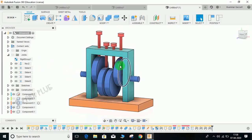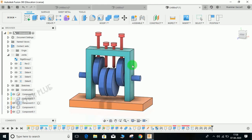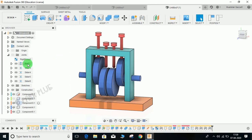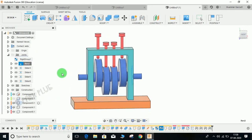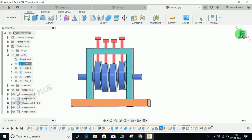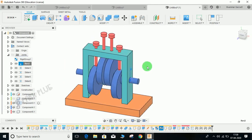Your assembly is now complete. Hide the joints, and when you move the cam all the followers respond accordingly. You can further add a handle and other details as desired. To animate, right-click on the Revolute Joint and click Animate Model — it will run automatically until you press Escape. Hope you guys enjoyed the video. Please comment any queries and suggestions for upcoming videos, and don't forget to share and subscribe. Thank you and have a nice day.